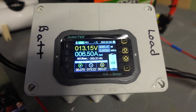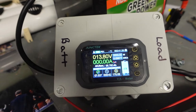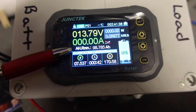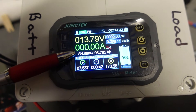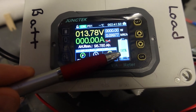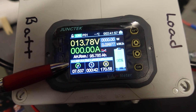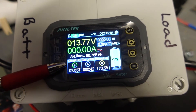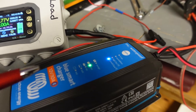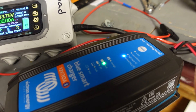So it's been charging for quite a while. The current's gone down to zero amps and the amp hours remaining is 98.785 amp hours - it hasn't gone above that to 100 amp hours and it hasn't gone negative either. It's at 98 percent charge and it's not going to get to 100. This might be nothing to do with the gauge - it's more down to lead acid AGM batteries, which sometimes just can't get to 100. The Victron charger is still running on float so it should still be putting in current.